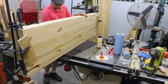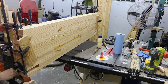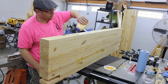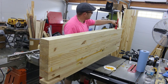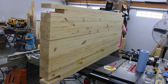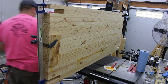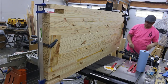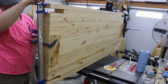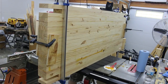I'm putting a couple more sub-assemblies together — same process: glue, cauls, then clamps. I only place clamps on the top side of the tabletop since that's the side I care most about keeping tight. I will be jointing these pieces so it won't matter if they're not completely square. The last sub-assembly ended up being three pieces because I had an odd number of sub-assemblies. Once I joined the two edges, I applied the two assembled sub-assemblies together to make the final tabletop.